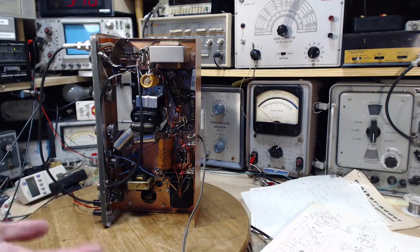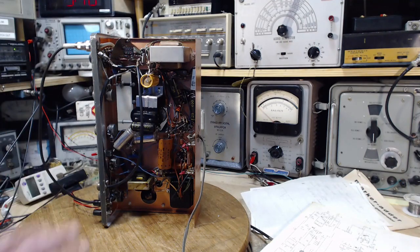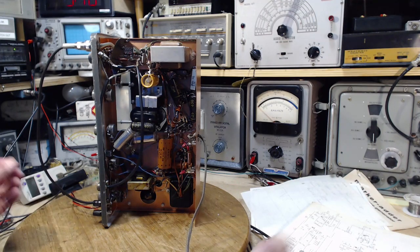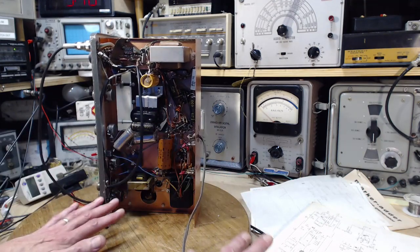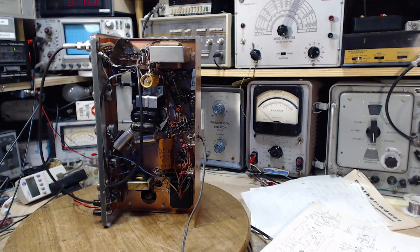And what do you do when you want to ground something? Well, you hook it up to the hydro neutral, hook it up to your water mains. So each of these stations along the line, where the power feeders come in, water pipes come into those stations, connections are made, basically, back to the tracks. The tracks are the negative side. They're laid in the ground, so they're at ground potential. And so everything's hooked together.